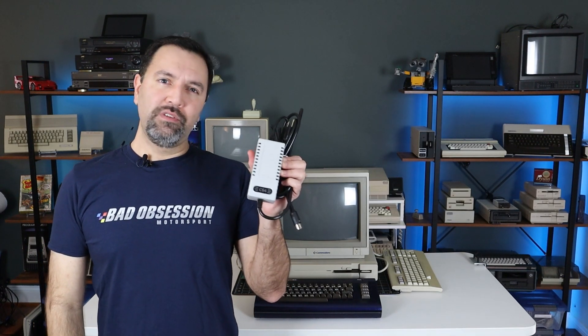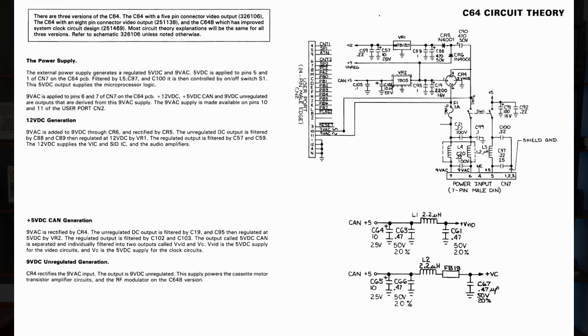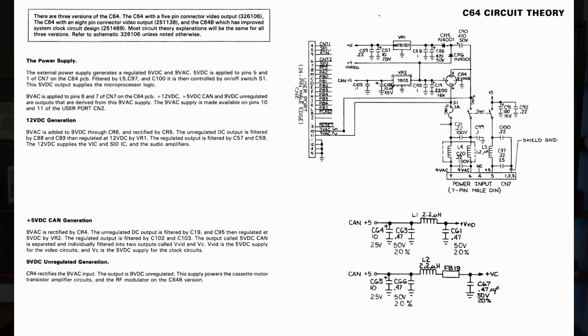I recently picked up this replacement C64 power supply from Keylog because it's compact, looks great, and appears to be well built. After receiving and testing it out, I did find something I think you should know before buying one. In testing, I found that the power supply is providing 13 volts AC at the 9-volt input when connected to US mains power. Under load, that figure should come down, but that won't happen unless you're actively powering something from the user port, such as certain RS-232 interfaces or EEPROM programmers. Voltage regulators VR1 and VR2 supply 12 and 5 volts DC respectively to the system, derived from the rectified 9-volt input. With a high input voltage, these regulators are going to run hotter than designed, which can cause adverse effects, especially on early revision bread bins that have no heat sinks. Because of that, and because Keylog is aware but hasn't publicly addressed the issue, I can't recommend this product to North American users. Dr. Dave's Diversion has a great video that explains and demonstrates the issue in more detail, so I've left a link to that video below in the description.